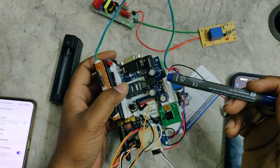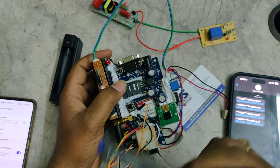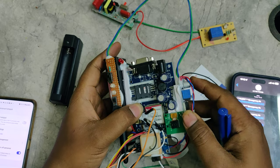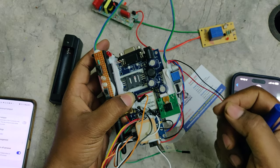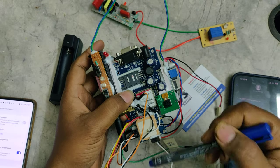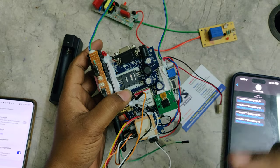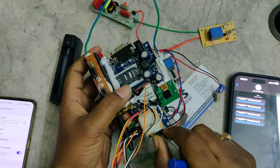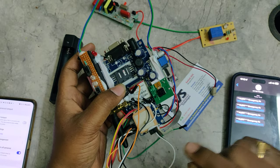The LED will blink on and off every two to three seconds, which is an indication that one loop was successfully executed. When a person is in a panic situation, she has to press and hold the switch for at least 1.5 seconds. Then the light continuously turns on, indicating the system is sending SMS first, then the email. This is a continuous process until the power supply is switched off.